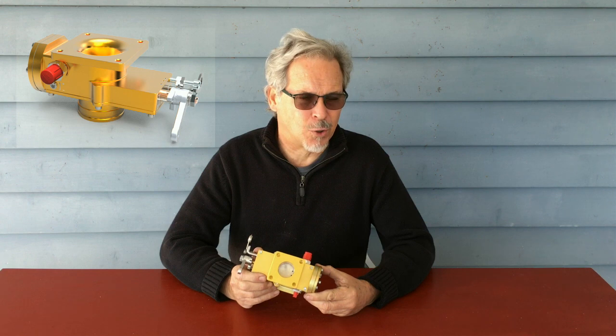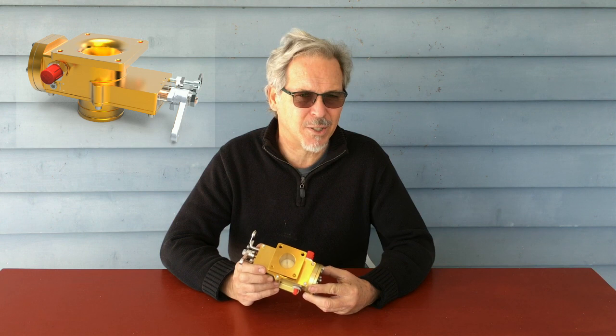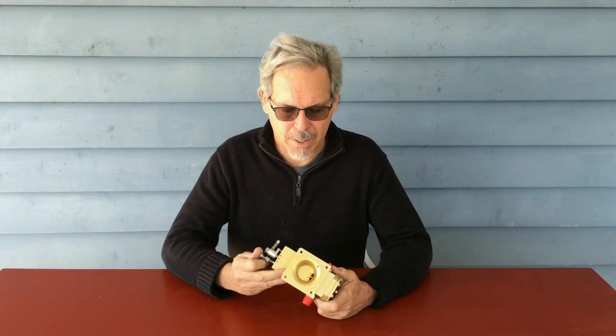Welcome back, WWFLY Corvair. Today I'm going to talk to you about a carburetor that we've had in testing all year. This is a Rotec TBI — it is a product of Australia. It is an excellent carburetor, and going forward in 2020, we are going to utilize this as the base carburetor for Corvairs. It is brand new, not a rebuild. It is clearly a flat slide carburetor, diaphragm controlled, and it fits the intake manifolds and fits into the space configuration that we've used for years.